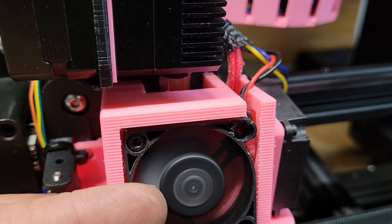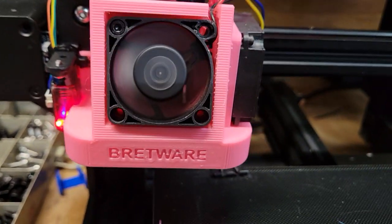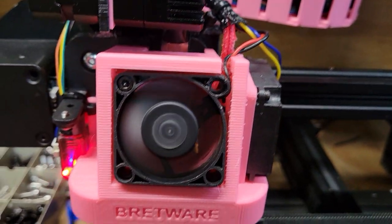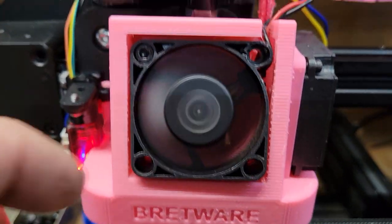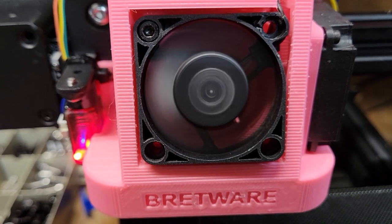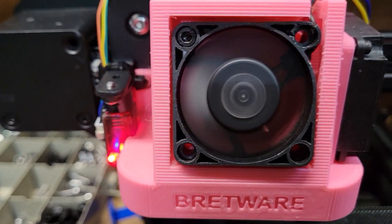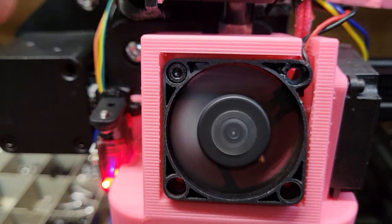You can hear how fast the fan is spinning — it's chugging right along. The old cover wasn't anywhere near as fast. I had a little swirl on the old cover to gauge speed, and as I started carving out the inside of this cover I noticed the fan picking up speed — it's a lot faster now. The old cover didn't like that high static, so the new design makes a real difference.